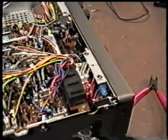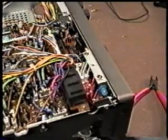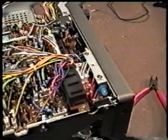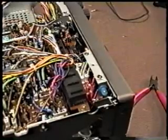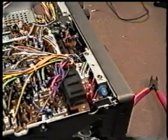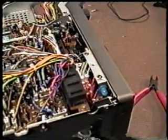Alright, the part number for the pilot lamp, the Kenwood part number, B30-0817-15. B as in Baker, 30-0817-15. That's the Kenwood part number on that 12-volt pilot lamp. Now that particular bulb is used in several of the Kenwood radios. It's used in the 940, the 440, the 140, and the 430. So if you have more than one Kenwood radio, you can order that and use that as a replacement for any of the 12-volt radios that use a pilot lamp in their S-meter.